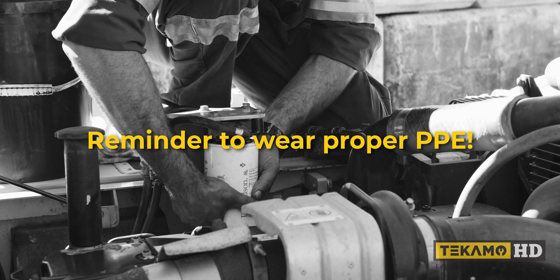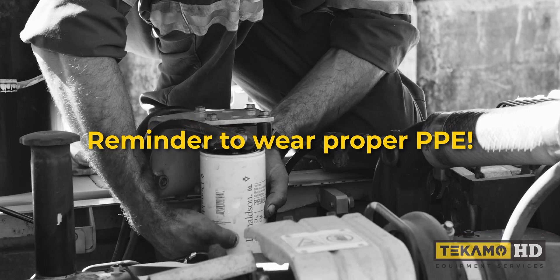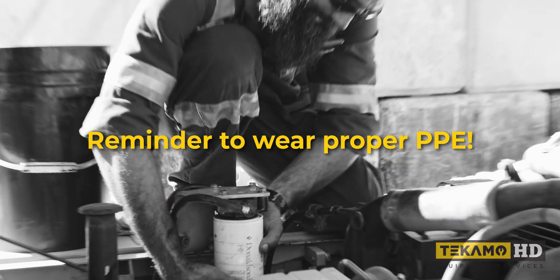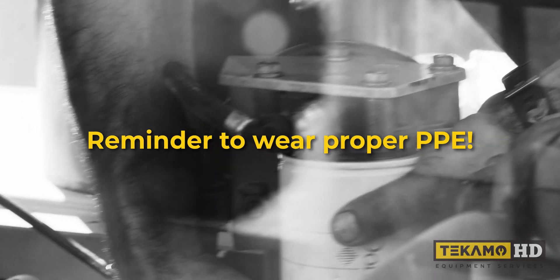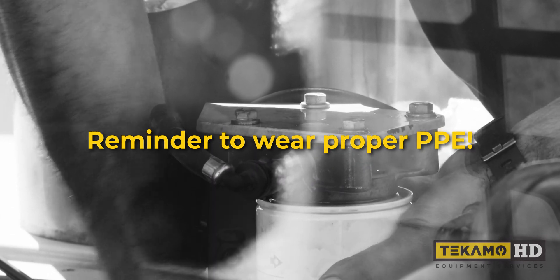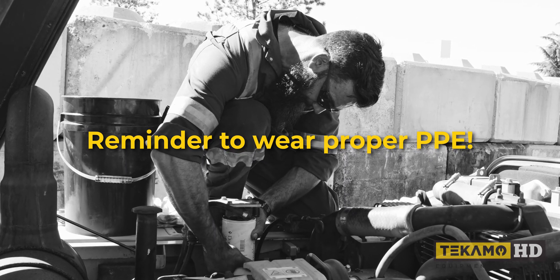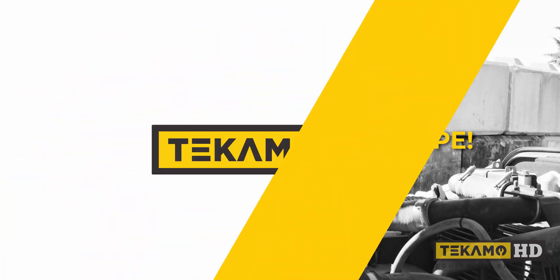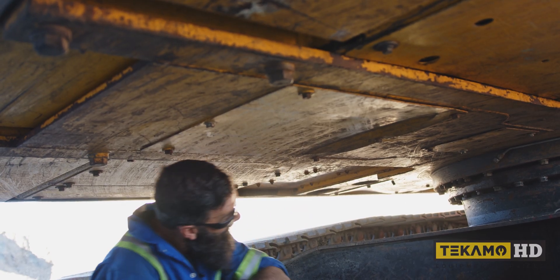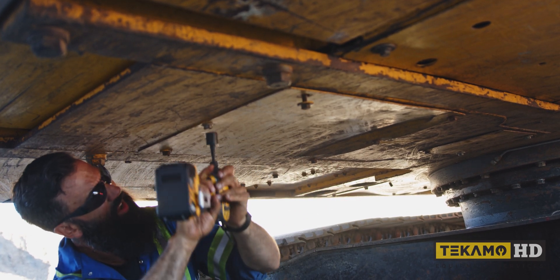I prefer to use PR88 on my hands as opposed to gloves, just for a little bit of dexterity. PR88 protects from the potential hazards of putting your hands in fuel, oil, and other petroleum-based products. Sean has already removed the belly pan on the bottom of the machine — be careful when removing these as they can be heavy and come crashing down from dirt build-up.